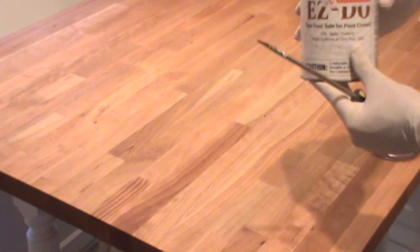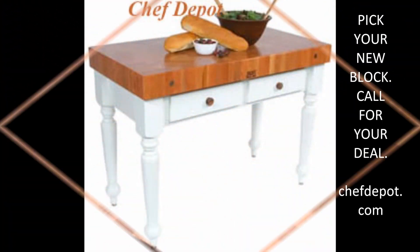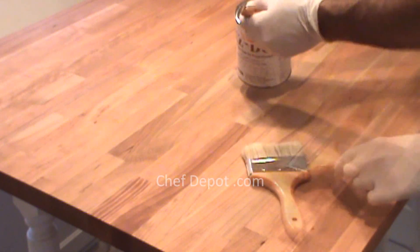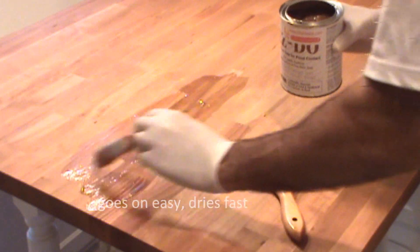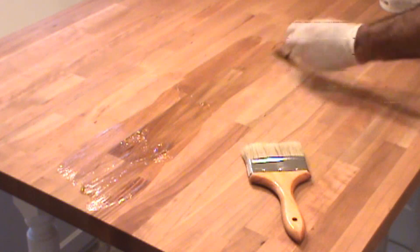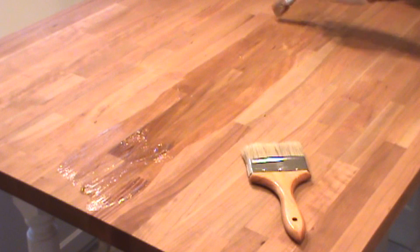Like I said, it's food safe for contact surfaces, non-toxic — that's what you're looking for. We're going to start in the middle and work our way out as we apply some of the sealer. I'm going to put a good amount right down the middle and then spread it out with the larger brush. It's not applied real thick — it's just to preserve and protect, keep out the humidity and moisture, kids and markers, and everyday use. This is what you need to preserve your butcher block.